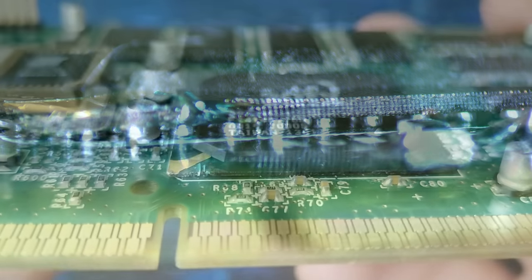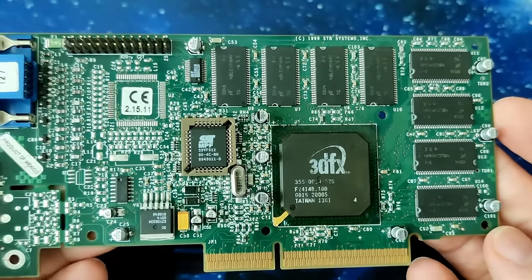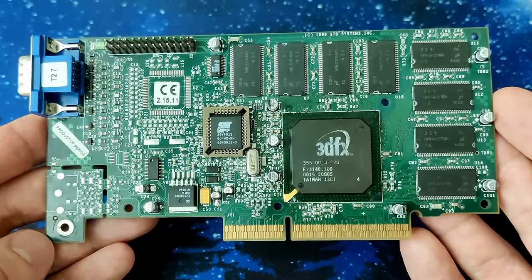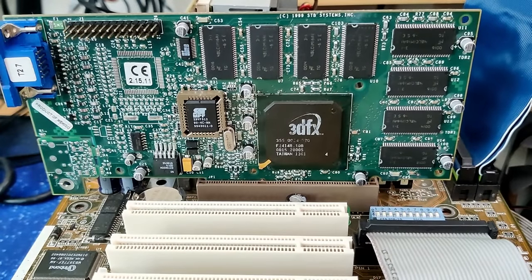Now we have a fully reassembled card. Here you can see the solder balls making a connection to their respective pads. Unfortunately, I may have used solder balls that are too small — instead of having a round shape, mine looked more like columns. Next time I'd rather take 0.65 or 0.7mm solder balls. Nevertheless, I am very happy that I went through the entire process of removing, reballing and resoldering a BGA chip. The question is, however, does this Voodoo 3 work now?